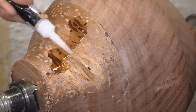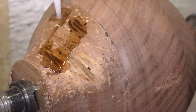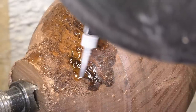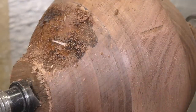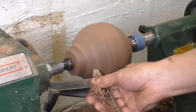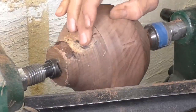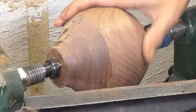So I had to do something about the wormholes, and I don't have time for epoxy to cure. Instead I'm going to use a different technique where I flood the whole area with superglue, then sprinkle on sawdust, rub off the excess, flood on more superglue, and alternate between superglue and sawdust until everything is filled up. Just a couple of rounds gives you a nice hard-filled material that you can sand and turn pretty much instantly. It's a really good option when you don't have time for epoxy to cure.